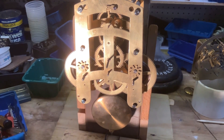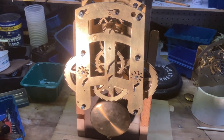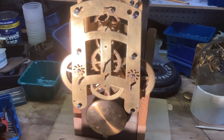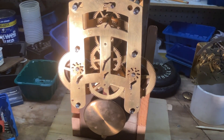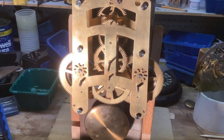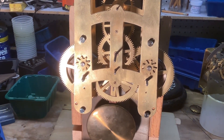There are two main wheels down at the bottom that have mainsprings on them. And then there are four wheels arranged one on top of the other up through the center. The wheels with the mainsprings wind counterclockwise, so as they unwind, they turn clockwise. This wheel at the bottom in operation turns counterclockwise, the wheel above it turns clockwise. That's the center wheel and the hands are on that wheel.